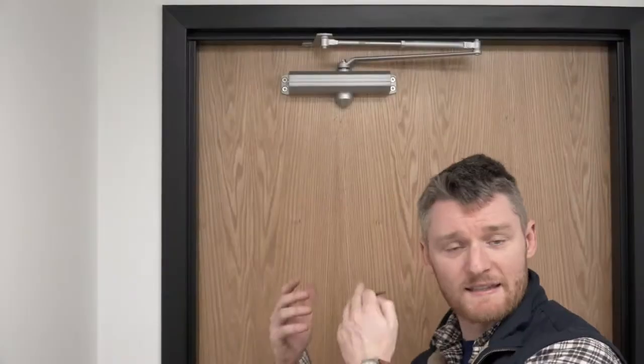And as you guys can see, it's now a nice clean shut. That's two quick and simple adjustments on a door closer. We only had to deal with our sweep, which was our close, and our open, which should be about five pounds. On the sweep, it should close at about five seconds — and that's just according to ADA, which allows for wheelchair accessibility to get through.